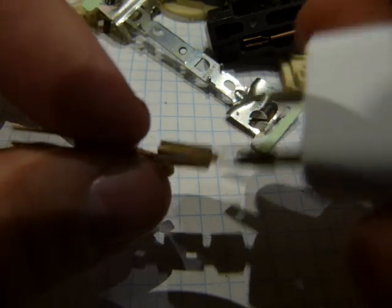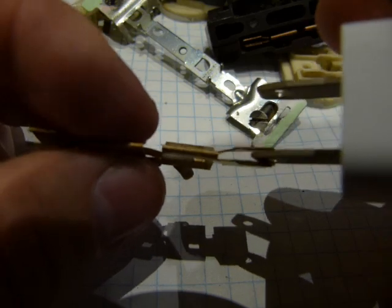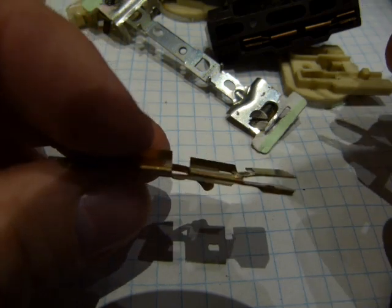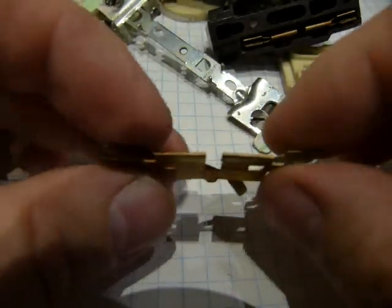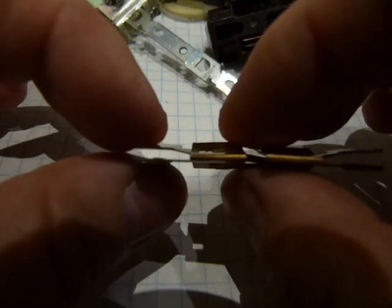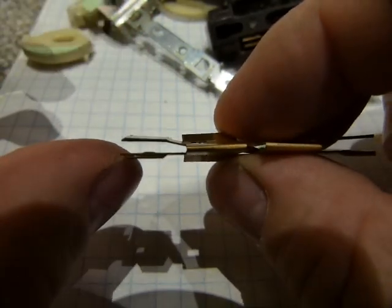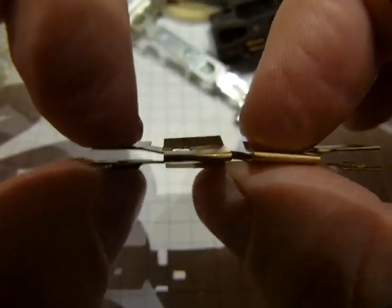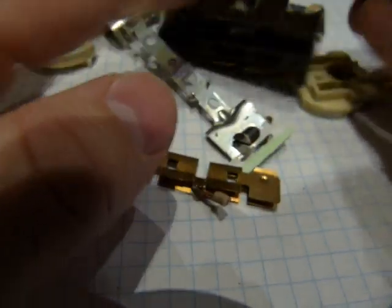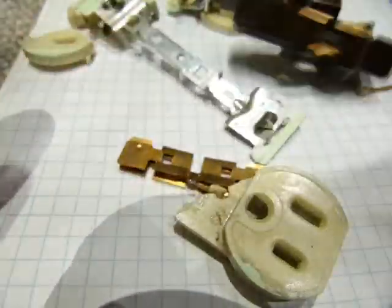It's gappy — not a nice fit. That's why in some bad cases these loose outlets don't even carry current properly. If you plug in your iPhone thinking it would charge overnight, it won't in some cases. Theoretically you could fix it by bending these metal plates back — you can see this lower one is still straight and this one is bent up and out. You could hammer on it or use pliers to force it back. However, it's just not worth the effort because you'd need to break apart the unit since it's riveted and glued.